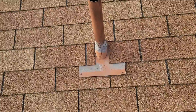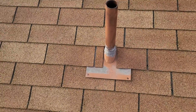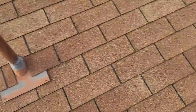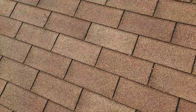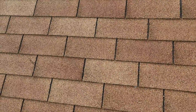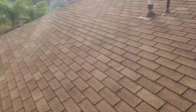All of the flashings were replaced and new flashings were added. That's a great sign that they actually took a little bit more time, attention, and money, because everything around this roof is properly flashed. When assessing a three-tab asphalt shingle roof, three-tab is typically old-fashioned so most are really badly worn. This three-tab roof appears to have the majority of granules still intact and there's not a lot of wear and tear showing on this north-facing roof plane.